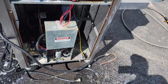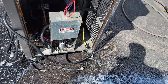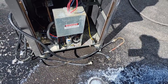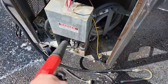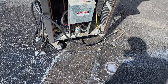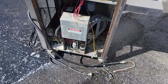Went ahead and just washed it out and flipped it sideways to let it drain. I'm going to grab my blower and blow everything off. The capacitor is the only thing that got wet - be careful around that high pressure switch down there, it's pretty much encased. Other than that we should be able to get it back in. They're cleaning up the other mess. Got all the capacitors dried out - this one here with the white crap all over it has been there a while, it's above the actual electrodes so it should be fine. Got the limit blown out, motors wiped off, tray all taken care of - let's put it back together.